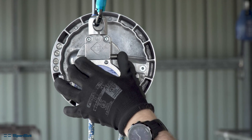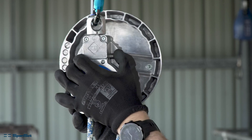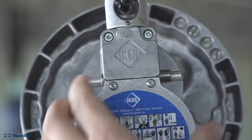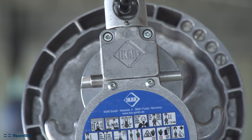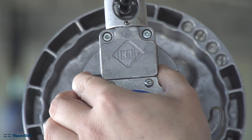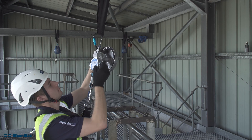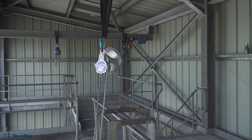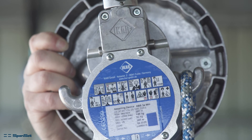When there is a load being held on the locking function, the sliding button will not be able to be moved by a single action, preventing the uncontrolled release of a casualty. If the button has been pushed all the way over from the lock side to the opposite side and not positioned back to the center, it will not impede or affect the descent, but you will be able to hear the locking ratchet function while lowering. If safe to do so, stop and hold the wheel and adjust the button back to the center.